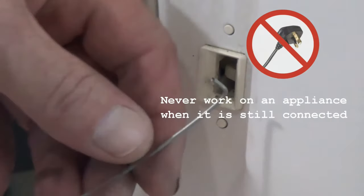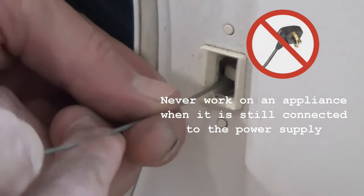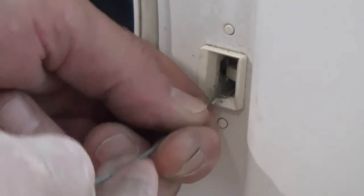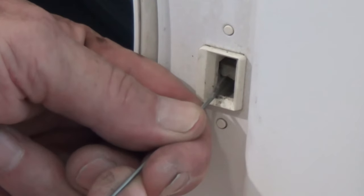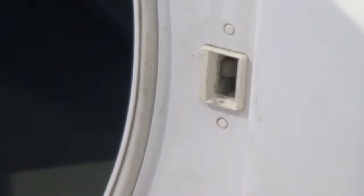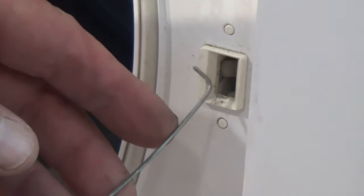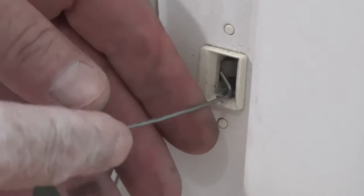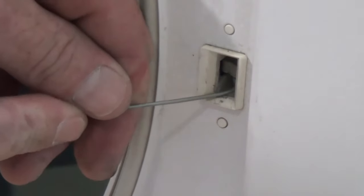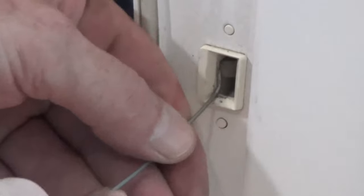To pull these into the open position, I've got a small piece of wire with a hook on it, which I put in and behind the lever and then carefully flick it back over. So if I reset it, you can see it's shut in the locked position and you have to pull it into the open position. The reason I use this small piece of wire instead of a screwdriver is because with a screwdriver you're actually levering it upwards, so with the hook you're able to get behind it.